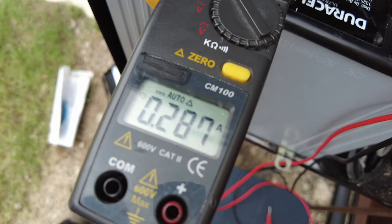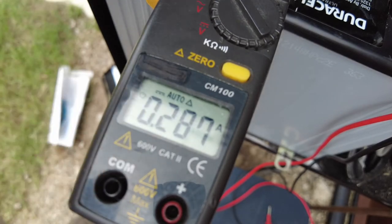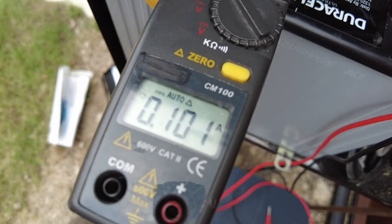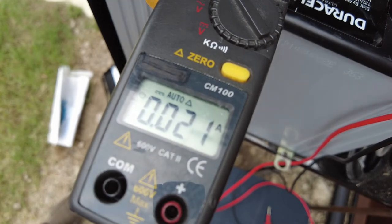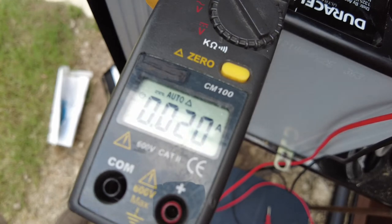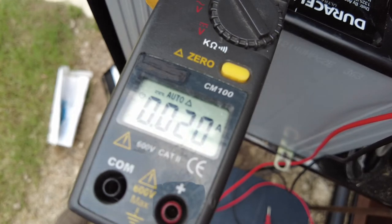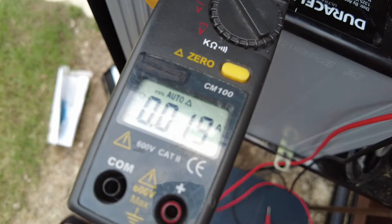So now I know that the board at full power is about 110 milliamps and the safety beam is pulling about 170 milliamps. And it just powered it down. So 150 to 200 milliamps is about the amperage rating I would expect for the type of safety beam that's out here. You can check the specs on the safety beam or various accessories — typically in the manual, or if not, you can call the manufacturer. So I'm going to unplug that safety beam again — it shouldn't affect the amperage.